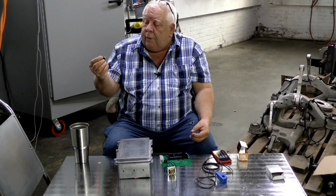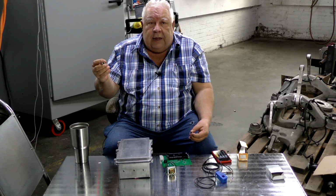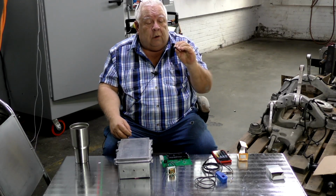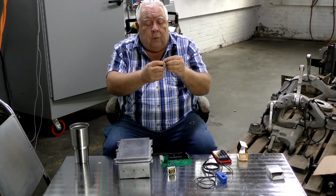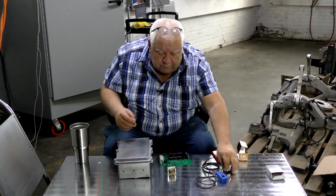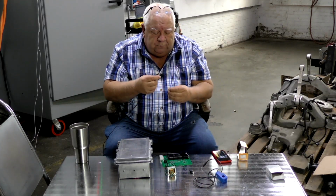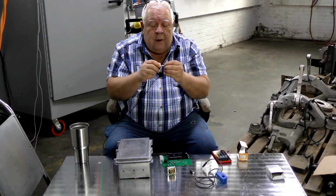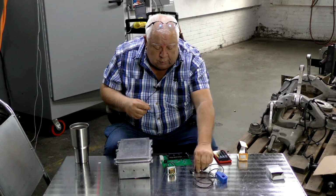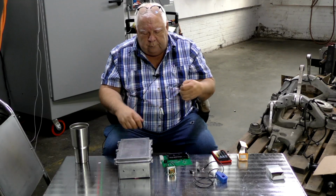So we can use very light audio jacks and cables that are relatively inexpensive, nicely pre-made. This one I kind of like because it has 3 screw terminals for sleeve, tip, and ring. This one is a little smaller, and you kind of solder them, and that's what we're actually going to produce with. And then you have audio cables that you can simply plug in to those jacks. They snap right in. It's a long established 3.5 millimeter audio standard, and it'll work great for this.